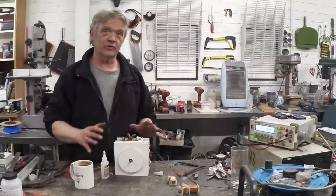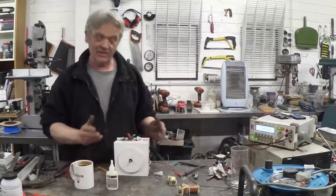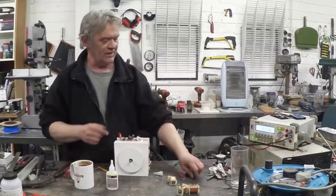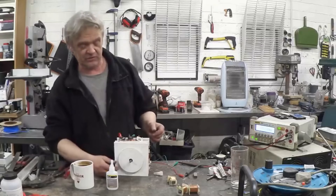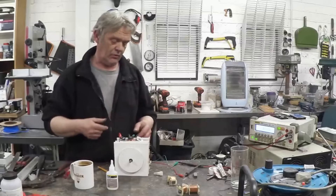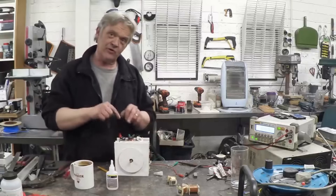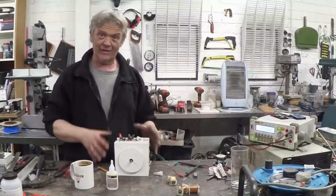We won't know which way round to wire these coils at this stage. So what we do is just pick a coil, attach a positive and negative, give it a spin, and we can get 1.1 volts out of that easily enough — so that one's working just fine. Pick the next one, give it a spin, and sure enough we get a volt out of it. Now take one of them, link the other two — if we spin it, we should get around 2 volts out of it. We're not — we're still getting 1 volt — so we've wired it the wrong way. Swap those two pins over, and lo and behold: 2 volts. When we did it the first way it was wrong because they were wound in different directions and fighting against each other. Now we've got them the right way, the voltage will add up, and we keep on adding those voltages in.